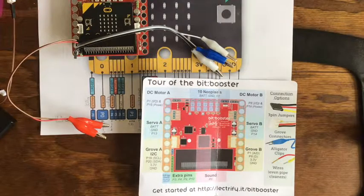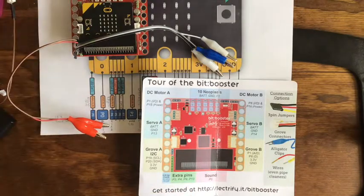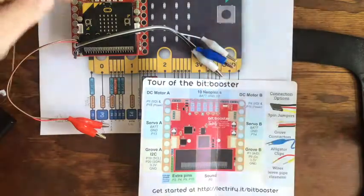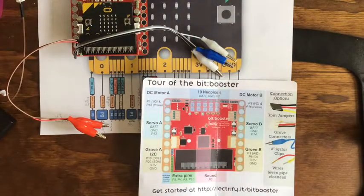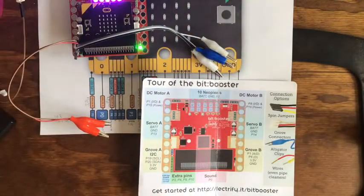I came back to the fact that there are four extra pins broken out: pins 3, 4, 9, and 10. The issue is that those pins are part of the LED matrix. So the one thing you have to do to make them usable is disable the LED matrix. You can then use those pins. I had to go find that out — it's just one block in MakeCode: LED enable false. I'll show you in a minute.